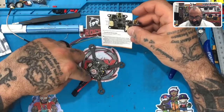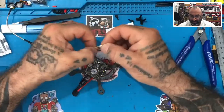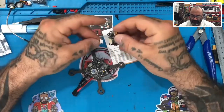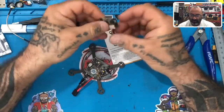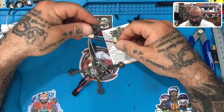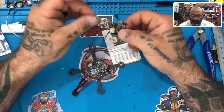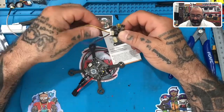We're going to take the video and that's going to go to our VTX. Looking at this wire harness, we're going to use the red and the black on the bottom, then the white, skip the next red and black, and only use the yellow.